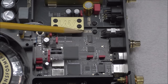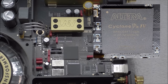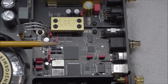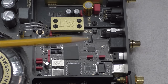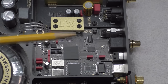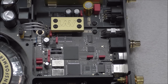I²S comes in on an I²S receiver. This is the Intel Altera Cyclone FPGA chip, which does all the basic signal processing. R2R DACs don't need to oversample — the ladder can do native PCM. But if you choose oversampling mode, the FPGA handles all the DSP, oversampling, timing, and jitter reduction. Then there's the demultiplexer — also called a shift register — which takes the 16-bit or 24-bit data word and sequentially feeds it into the individual resistors on the ladder itself.